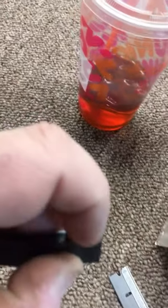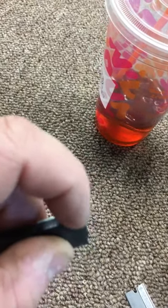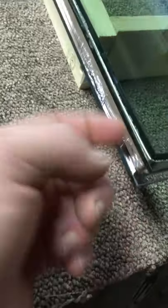It has a release on each side — a self-adhesive sealant where you peel one side, set that side, and then once one side is set you peel off the second side. We had set up a little queuing station to make sure we put the panes together exactly the same. We just butt the pane here and here with the spacer on one side, peel off the release tape, and then set the second pane right on. It's pretty straightforward.